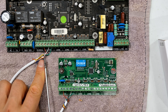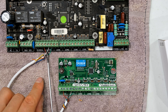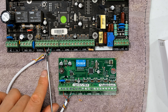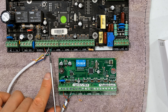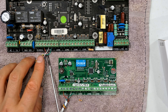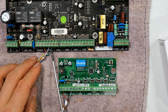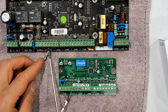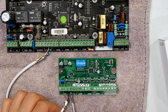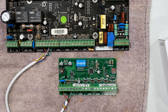That means that in your alarm system you may already have wires sitting here. You might have two or three keypads which means you will have a few of the red and black and a few of the data plus and data minus wires. It is not a rule to use white for data plus and green for data minus — you may choose your own colors as long as the data plus correlates with the data plus on the other side, and the data minus is the same wire.